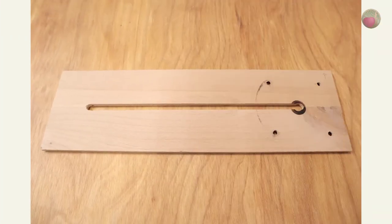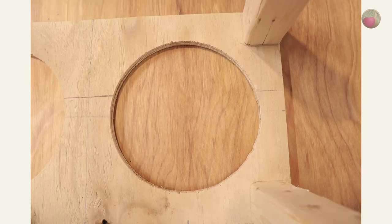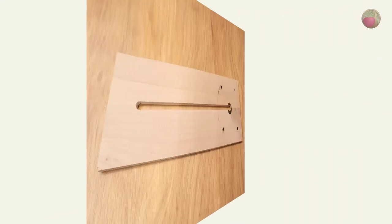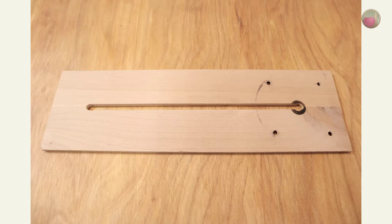I'm using quarter-inch plywood for my jig base, and I could probably cut three-quarter inch plywood using this thin board for my jig as well. Next, let's measure the length of your jig. Determine the radius of the biggest circle you want to cut — that's the distance from the center to its edge. Add to that the width of the naked base of your router (meaning without its base plate), then give yourself an extra few inches for the outside edges of the jig. All that added together is the length of your jig.